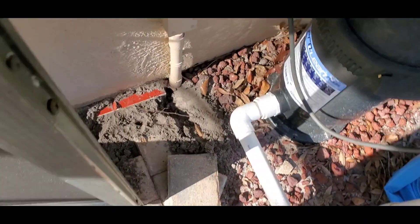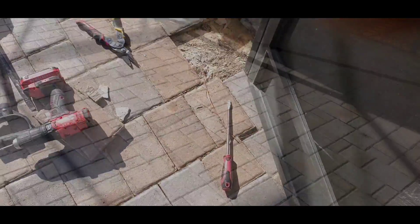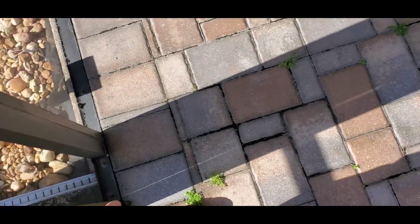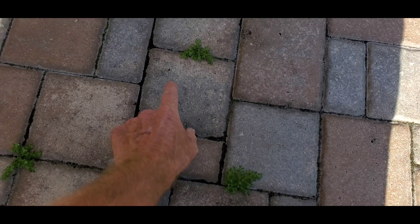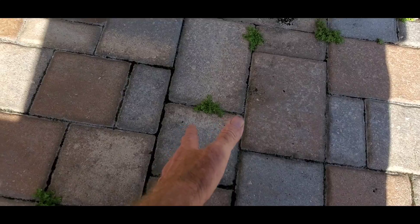We also found the line out here. You can see it just discharges into the dirt — that's why the system doesn't work. I actually see this quite a bit. What we can do, rather than cut out the channel drain, which is very expensive, is we can actually drill holes using our hammer drill and our core bit right down through the paver — three, four, five, however many we need — to allow this water to drop into the system. Really a straightforward problem, not expensive. Great project for the do-it-yourselfer.